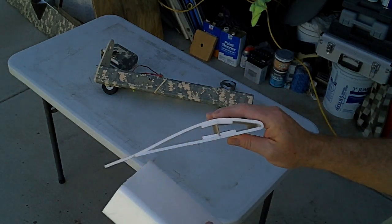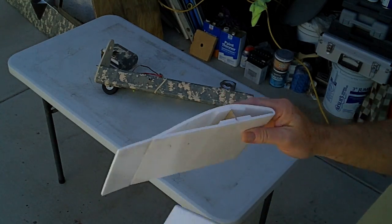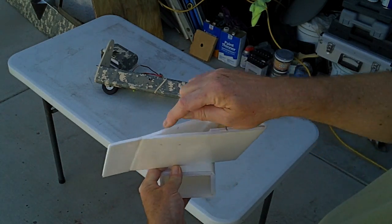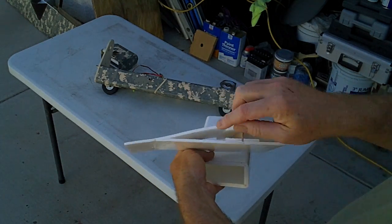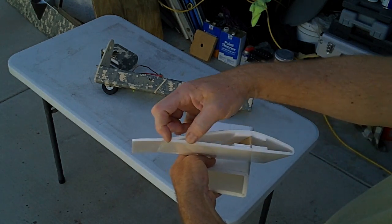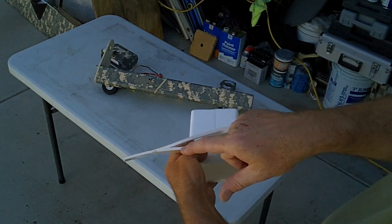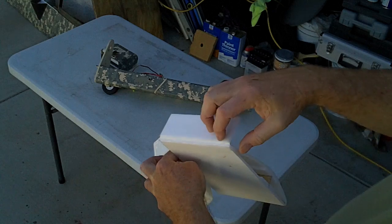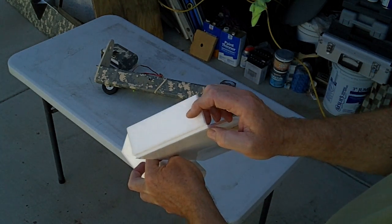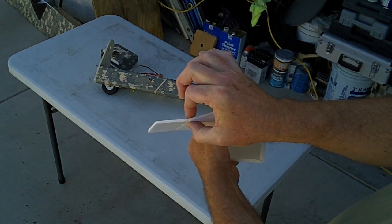Now this wing chord is a little small for this plane and this load, in my opinion, so I went with the full sheet. In other words, it was 9 3/4 to here, about 9 3/4 back. The technique right here is that you're sanding flat the bottom sheet. You take the paper off 1 inch off the bottom on the inside, then take a sanding block and sand it down to near 0. You leave just a tiny bit of the bottom paper. Don't disturb the bottom paper when you do the sanding, and that way the two come together to create only one thickness right here.